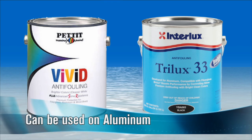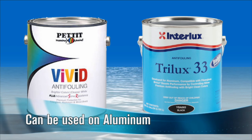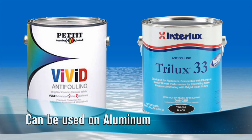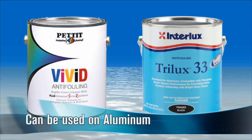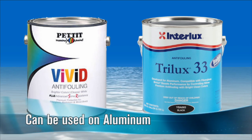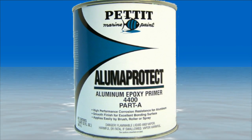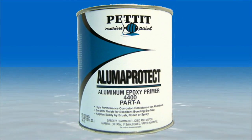Since copper and aluminum are dissimilar metals, applying a traditional copper paint directly to an aluminum hull would be disastrous. Galvanic corrosion would begin immediately, and the hull would quickly deteriorate. For best results, aluminum boat owners should still prime their hull with an appropriate zinc chromate or strontium chromate primer, such as Petit Alumiprotect, before applying either Vivid or Trilux 33.